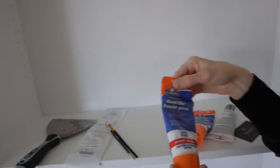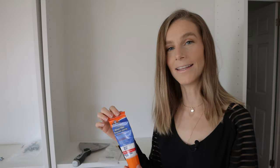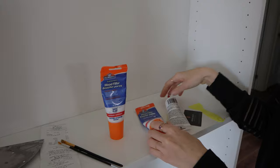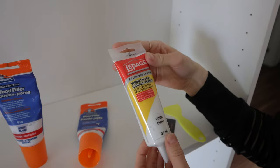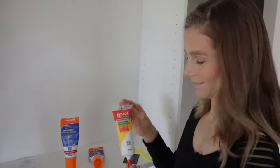What you'll need is either Elmer's wood filler in white — don't get the one that's pink and then dries white, because I tried that and it actually dried pink and then we had to paint over it, so it was a nightmare. Just get the ones that are wood filler in white from Elmer's, or this one I saw at Rona — it's Lepage. Wood filler in white.